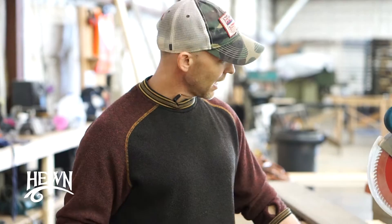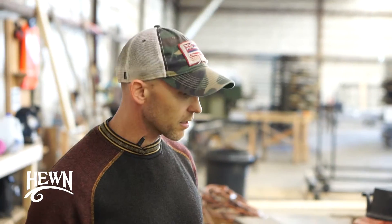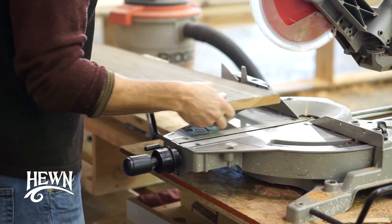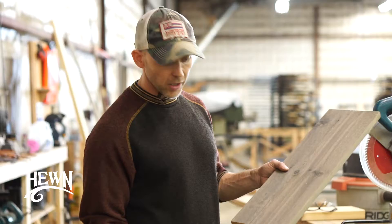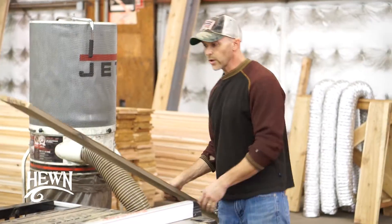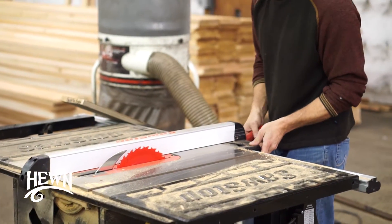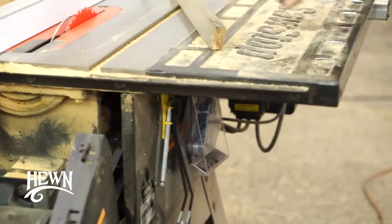The first cut we're making is 36 inches — that's going to be the height of our wainscoting — and then we're going to come back and put that 10-degree angle at the top. Make sure you square cut the end; sometimes the factory end isn't true. We're going to butt a couple of these scraps together and utilize them — it's got a real reclaimed salvage look, it's worth saving the material. We're going to rip one of our boards at a 10-degree angle to match the angle on the top of the vertical boards. You see that angle? That should match perfectly.